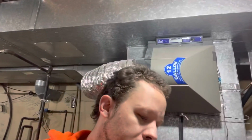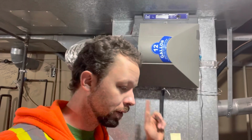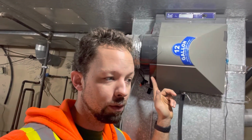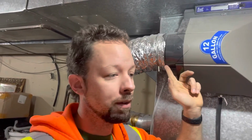Again, you don't really need these fancy things. Your Nest thermostat will do it all for you. All you have to do is connect your common from the relay that allows the water to run. And I haven't opened this up in a while. I do have to check that, but it just basically has a waterfall that comes from the top of this down to here, and it's a pass through. In the summertime, you'll actually just turn it off because you don't need that bypass.